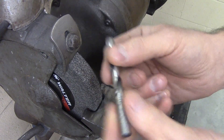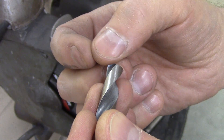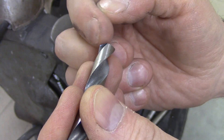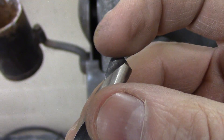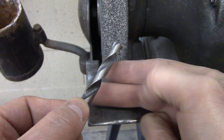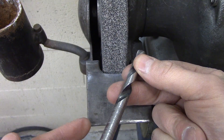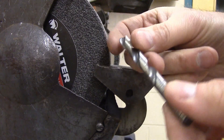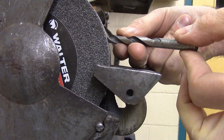On this machine, you want to come at it with this cutting edge completely horizontal. So I take this cutting edge, make it horizontal, rest on two fingers, and have this shank line up with that corner of the table. From the side, that sharp edge, two fingers, come at it like this.